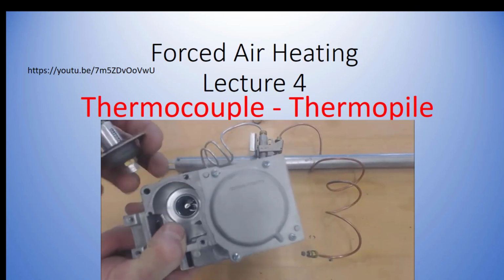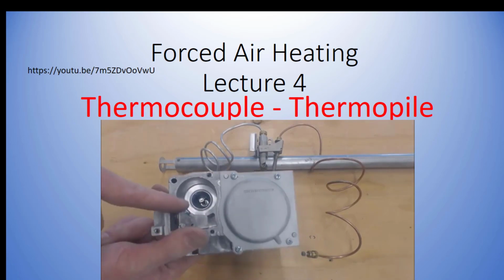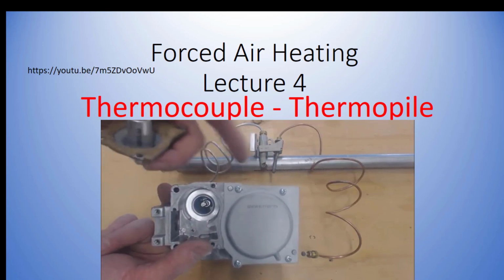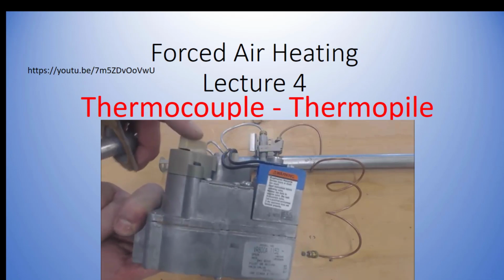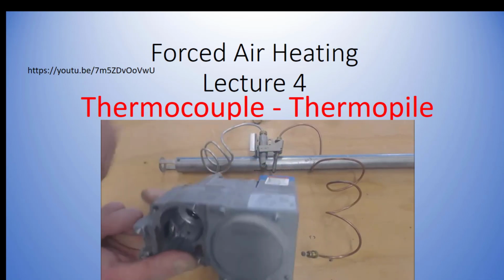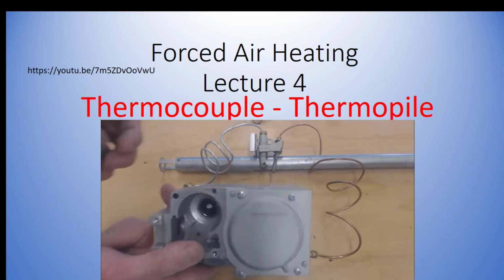Every time that you do that, you're allowing the gas through. So here's where it enters, and it comes through, and it's allowed to then go down into the main part of the gas valve. The thing is, once you let up on this, you want this to be stuck up, okay? So it allows the gas from here down into the lower portion.